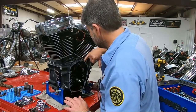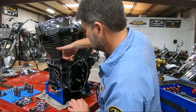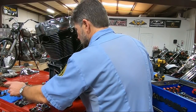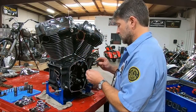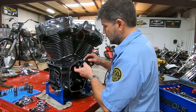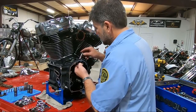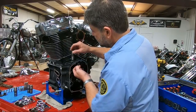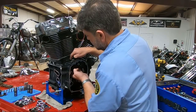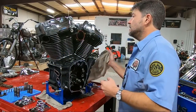If I look inside the bores, they don't look scarred. The bores themselves don't. I'm going to slide a lifter in there just to see. It's not excessively loose — a little tight, but that could be from the dirt. That doesn't feel too bad either. Let's open the top.